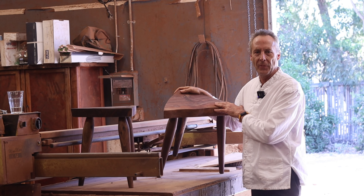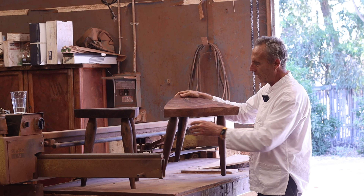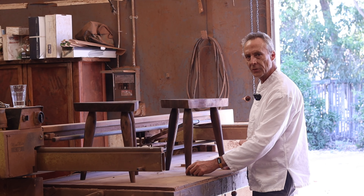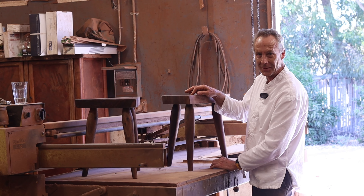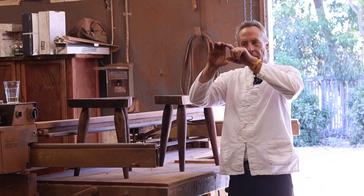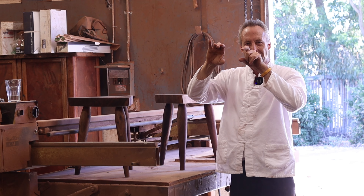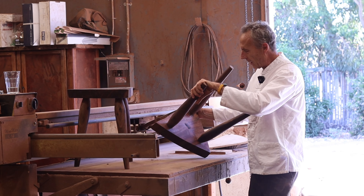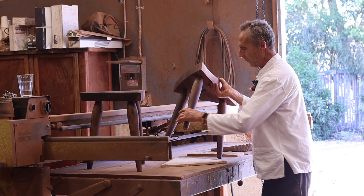I don't want to see a lot of fill in between there — you will see some fill, everybody has a little. But I want to be able to put the leg in and fuss with it a little bit, move the end maybe a half inch. So it can't fit really tight at the bottom, but it has to fit pretty tight at the top. So when I turn the end, I taper it a little bit so it can play a little bit and still reach the top really nice.